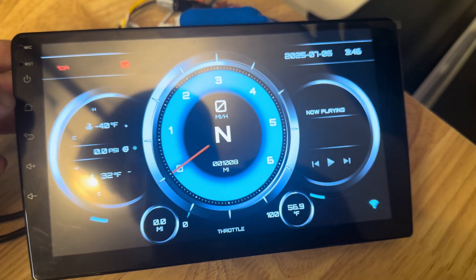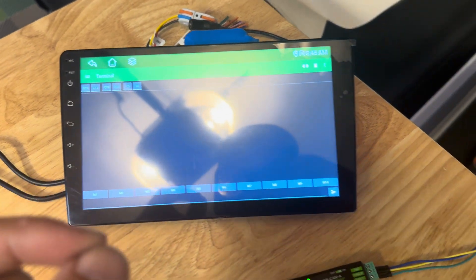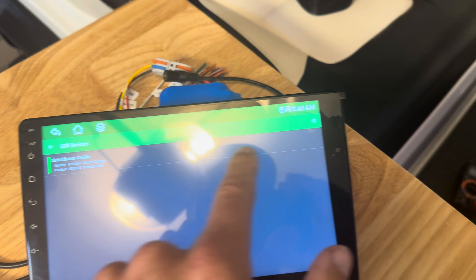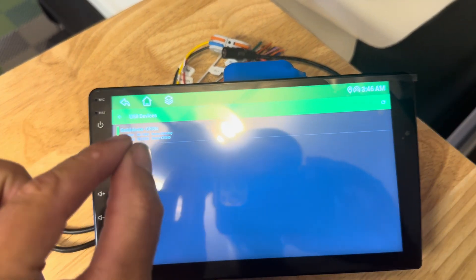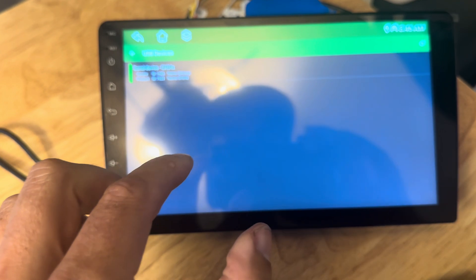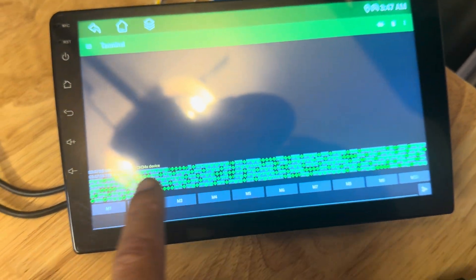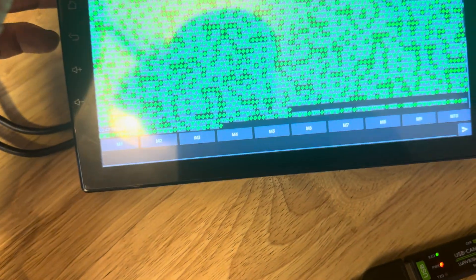Because these displays run Android, one of the first things I did was use a serial-to-USB terminal. I used this software to make sure I could see my serial adapter. You go into settings, go into USB devices, and you should see that serial device appear. This is a good sign — it means the drivers were detected and it's using the CH340 serial-to-USB adapter. This one's running Android 10 and it did detect our serial-to-USB adapter. If you hit connect, you can see the data starting to feed in. The buffer is going to overflow because of the speed, but you can see data is flowing.